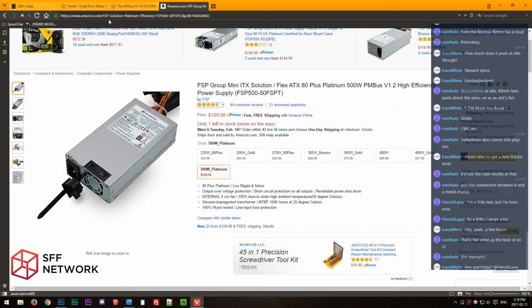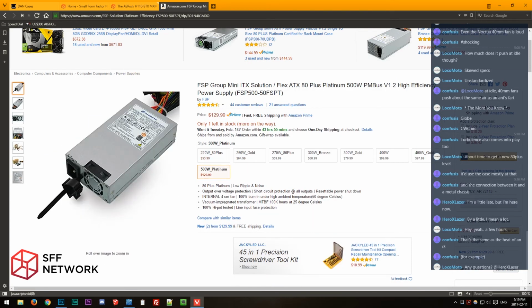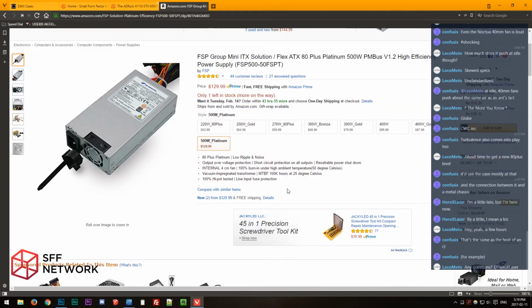So if it's running at ambient temperature, you've got a massive heat sink, like a Noctua D15 or a water cooling setup, and it's running at ambient, it is drawing less power than if it's running at elevated temperatures, because it's able to run at a little bit lower voltage, so it's a little more efficient, but it's not a huge difference. Overclocking is a whole different matter, but for the most part, no matter the temperature, it is generating mostly the same heat. It's just how good your cooling is at dissipating the heat. So the processor runs at a lower temperature, but the actual heat generated is about the same. So the only way to reduce the actual heat generated is to consume less electricity to begin with. That means undervolting or just getting a more efficient system. But yeah.